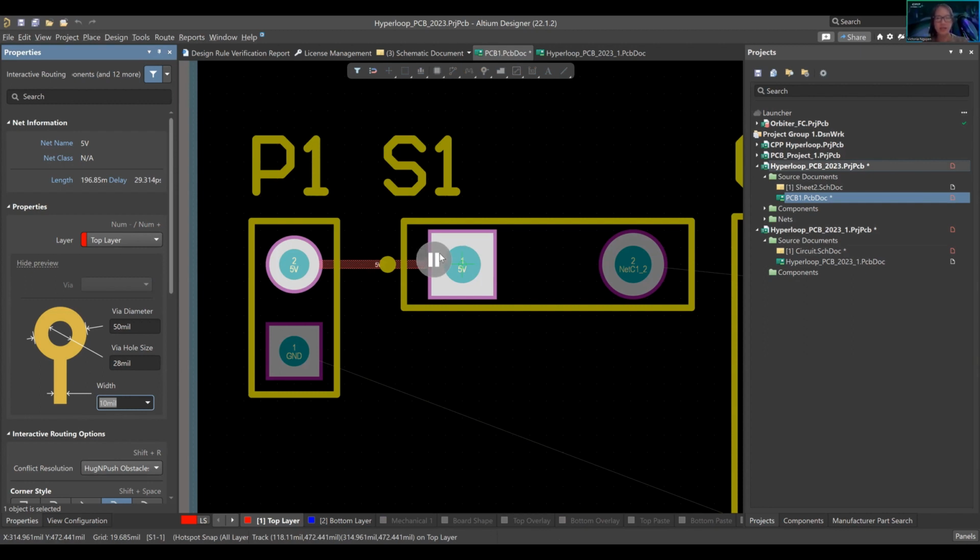This is sufficient. We don't have time to get into this, but if you're an electrical engineer or a PCB designer, the one app I highly, highly, highly recommend you download and look into is called Saturn PCB Toolkit. Saturn, like the planet, PCB Toolkit. It'll basically help you understand, for this kind of amperage, how much conductor width do you need? How much copper do you need? For this fuse, what's going on with it? For this kind of layer stack-up, how many vias do you need in it?